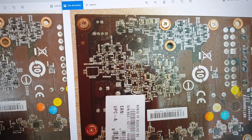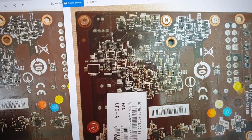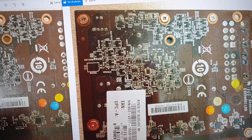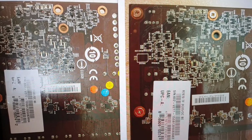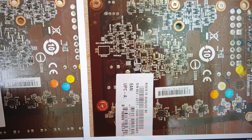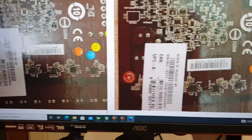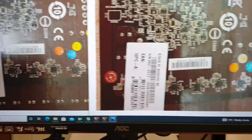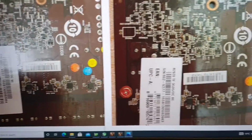If you don't have voltages, it's not worth it to start soldering straight away, like replacing a drop down regulator. It's probably better to search and to draw a little bit of schematic, and yeah, it depends on your skills. But in this case, if I have a microscope and I'm in the repair shop and I go through the board, I will spend 10 minutes. I will probably figure out that there is a missing component. So yeah, now there is a missing component, so nothing is burnt there.